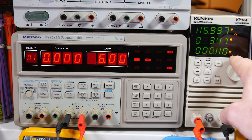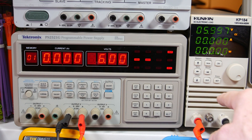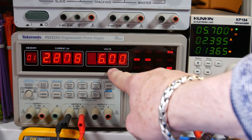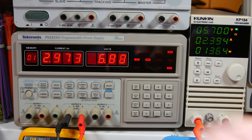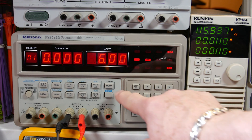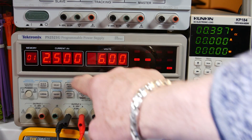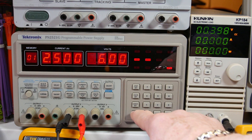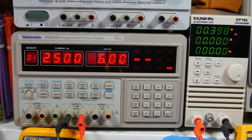Let's go to constant current. Let's set that up — let's just leave it there at 2.4 amps. Now it's just waiting to do something, so I can turn it on. This power supply was already on. So right now, these things are matching up pretty well. The power supply here is set to 6 volts out and 2.5 amps current limit — that's 2.5 amps per side, so it's kind of maxed out right there.